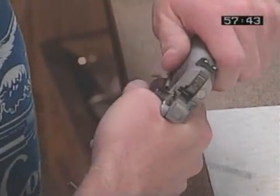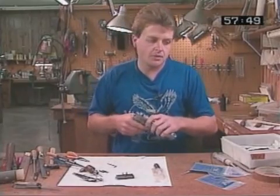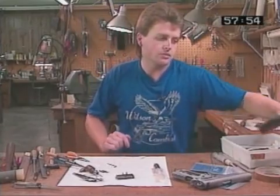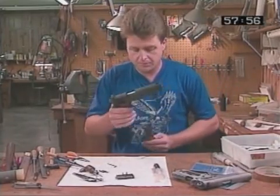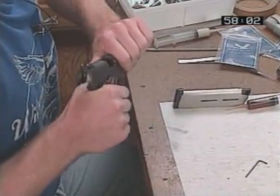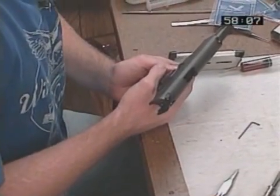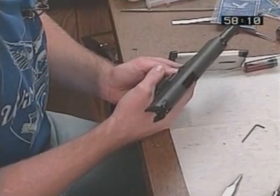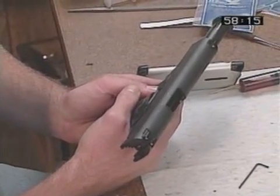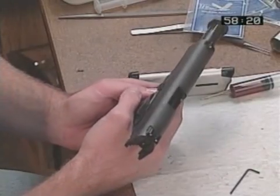I believe we pretty much got what we need. Now we can check on another gun we have here on safety checks after the trigger job is complete. First thing you need to do is lock the slide back, and as you hold the trigger forward, drop the slide to make sure you've got good engagement. This gives you an actual check between the sear nose and the hammer hooks. Hold the trigger forward, and release the slide.